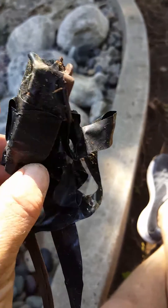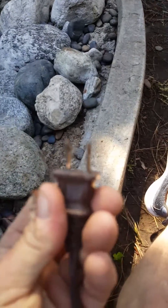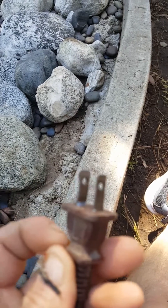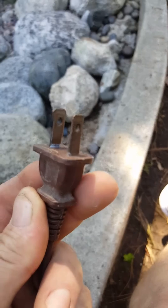Don't wrap your cords with electrical tape. Hang them upside down so that the holes are upside down. But in this case, this is ungrounded — there's no actual ground on this. You do not want to use that for any submersible pump outdoors or for any reason, especially if it goes in the water. That's a very unsafe practice.